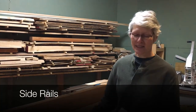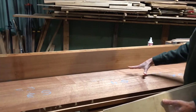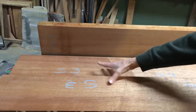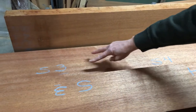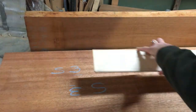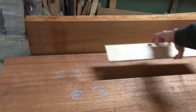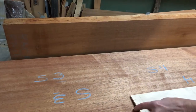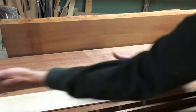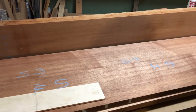For the layout of the side rail and center front rail for the chairs, we took two pieces of lumber that are bookmatched — basically opened them up — and these will be the outward-facing parts of each of the rails. We laid it out so that the grain is in line with the railing, rather than angled, since occasionally it might not be perfectly straight. On this one, it's a little more angled, so we set it so that the grain would be pretty much straight on all of the boards to give a uniform look from one chair to the next, especially on the fronts.